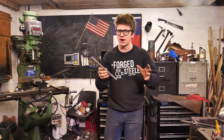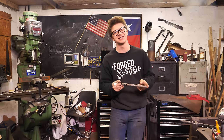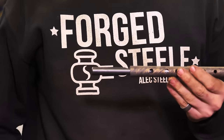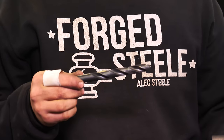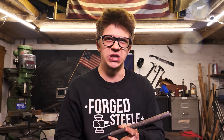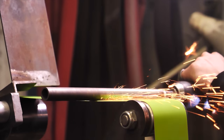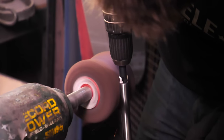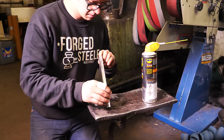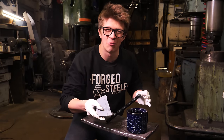Okay, this has been heat treated. It's now ready for the final polish and then the etch. Very exciting. Now, I didn't want to do this on the lathe because I don't want to get dragged into it. So what I'm going to do is take a drill bit, hold this in my drill, put the drill bit inside here. It spins, so I'm going to try and wrap this in some tape and force it in. Once that's in there, I'm then going to go to the belt grinder — I'm going to go to a 120-grit ceramic, a 240-grit zirconium, then to a trizact belt before we go into the etch. I'm now going to put the final polish on this with some 2000-grit wet and dry and a mug of water.